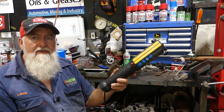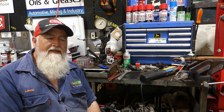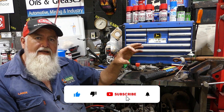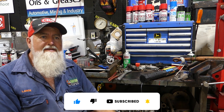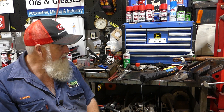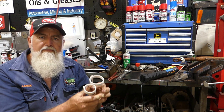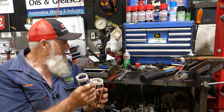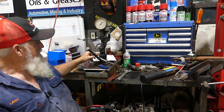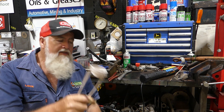It's a handy thing for the workshop for sure. If you had a couple of nuts giving you a bit of drama and you didn't have an oxy torch, I think that'd get you out of trouble. It says it will do up to a 40 millimetre nut — so on a 40 millimetre thread, which is pretty major. But at two minute intervals, I only think you'd get a couple of goes at it. These induction coils — you get 30, 40, and 50 mil, two of each with the kit, plus a couple of blanks you can make any shape you like. If you want an odd shape or you're going through them and using it a lot, you can buy these separately. The user manual is mainly about safety — don't use it over a pot of petrol and things like that.